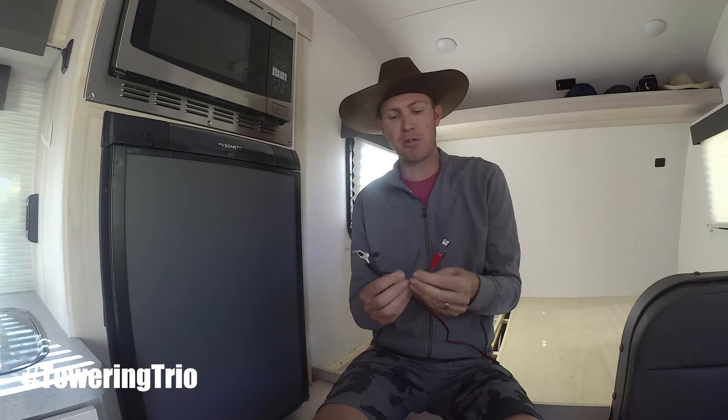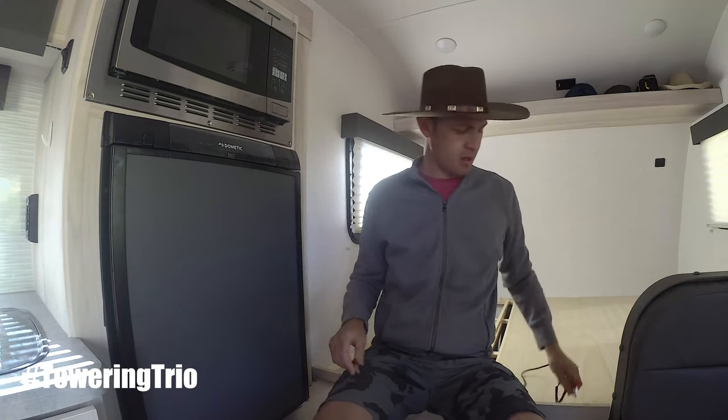If you have any questions about this, just leave a comment below and I'll do my best to answer it. It's a really simple process. I want to show you that this works — you might be a little skeptical, but in theory it should work, so I'm going to show you. I'll jump across the camera and turn on the furnace. You'll hear the fan motor kick in and it's going to run for 30 seconds. If I don't close the sail switch or touch these two jumper cables together, it'll just shut off after 30 seconds — and it does this two or three times before it goes into lockout mode for protection.